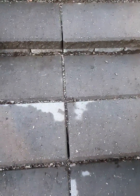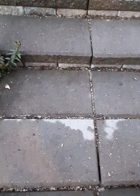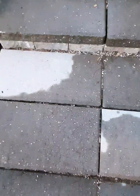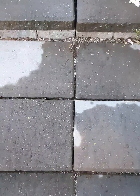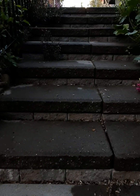You don't have to worry too much ahead of time, because the land will tell you as you go step by step from the bottom up: do you need to put them at the same level or do you need to step up? For me, I needed to have 2 landings in here where it's at the same level, and then the stair went up.